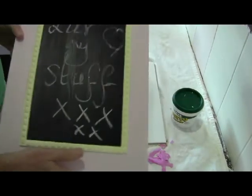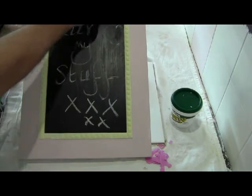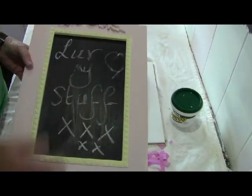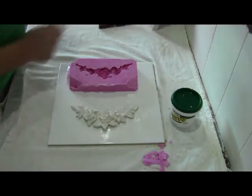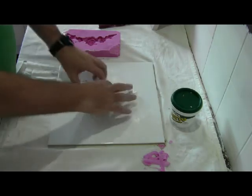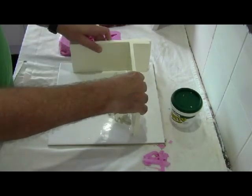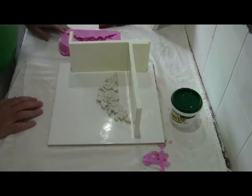Find a piece of inspiration. In this case, it was a nice little picture frame with a beautiful carving on the top that we decided would look fantastic on a whole range of creations. So we decided to take a mould of that. To do that, we took that off and used the mould box, which is a large ceramic tile. Placed it on there with the putty on the back, and then boxed it up using our mould box. Puttied up the sides to keep it nice and watertight.